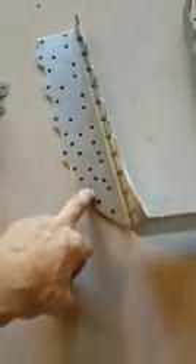That is the hanger that's going to be holding up all these trusses. 66 three-and-a-half-inch nails are going to go into the beam itself, and 22 one-and-a-half-inch screws going into the trusses to hold everything in place. We have ten of these going in — one for each one of those floor trusses.